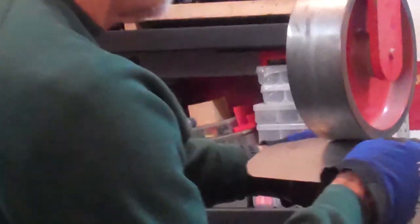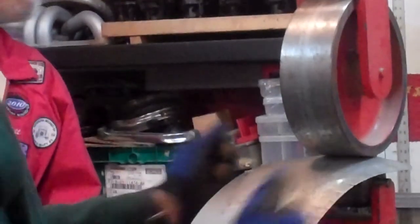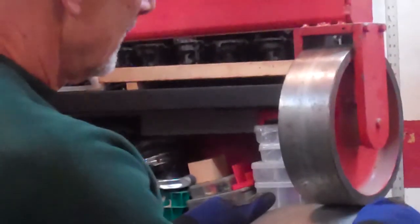Would you be able to get those ripples out with that wheel? Yeah, yeah. Let's smooth it out — see, when you hit one and it stopped, you back off because it stopped. Back off the wheel a little bit, run it through, and then tighten the wheel down again. I took a seminar — see where it's smoothing out here — about 20 years ago. That's just an English wheel — Faye Butler.